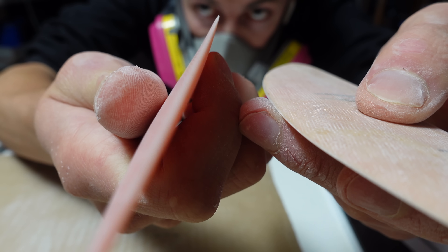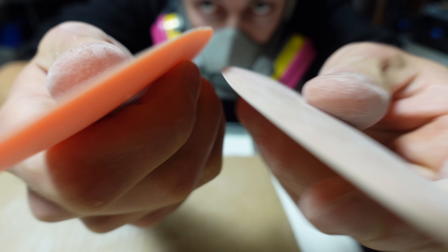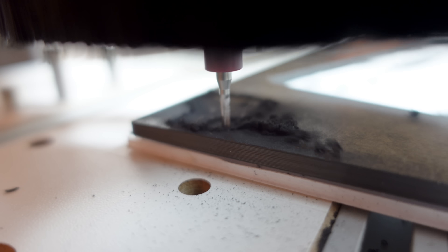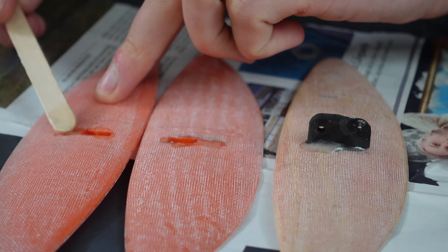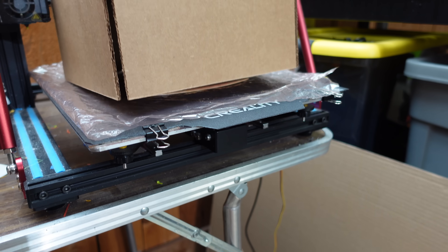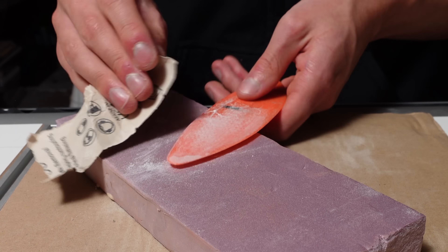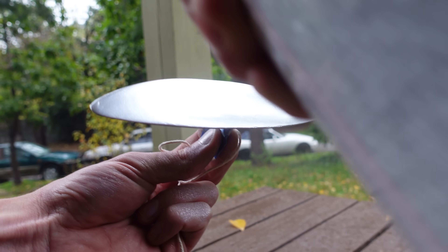It's very important that hydrofoils are super smooth because water is 830 times more dense than air, so any little impurities create a ton of drag. Next, I cut some little tabs out of 4mm carbon fiber plate on the Stepcraft and epoxied those into the foils. I cured them on my 3D printer bed, did another glaze of epoxy, and sanded that down smooth too. Then came a layer of spray paint to finish things up, and that just about does it for the foils themselves.